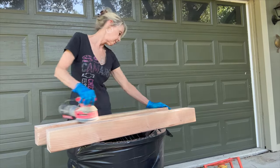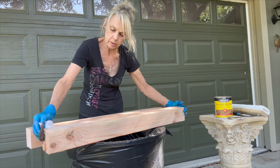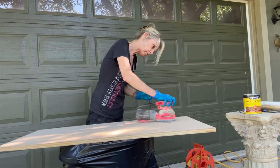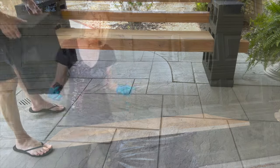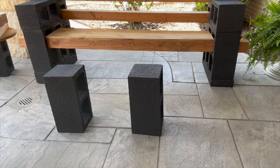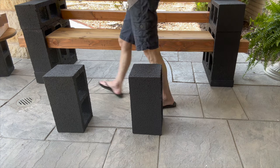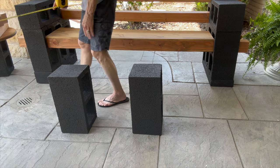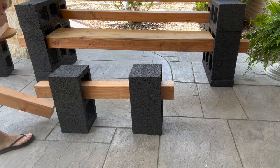For the coffee table, I took two of the same 4x4s and cut them shorter, putting them through two more black painted cinder blocks. I sanded and stained them, then got a piece of plywood for the tabletop — sanding, staining, and sealing it with a Minwax polyurethane sealer on all pieces. To assemble, I faced two cinder blocks toward each other, did a lot of measurements before placing the top, and once I had it exactly where I wanted it, I drew a pencil square around each block so I knew exactly where to place it back. I put one board on top and one on the bottom, hanging them out the same length as my bench so it blends.